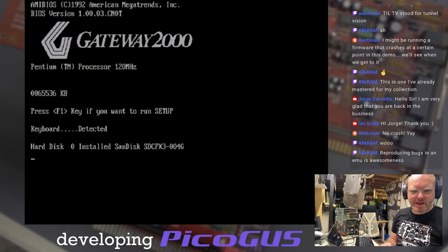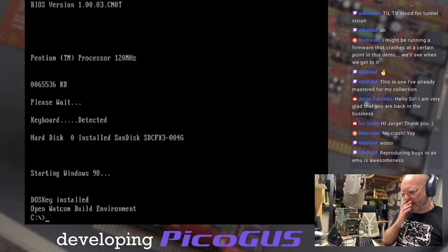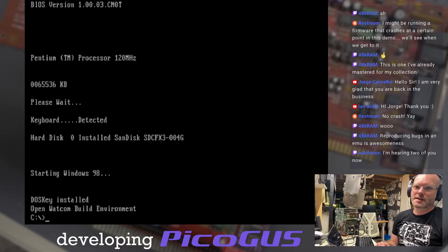I'm going to kind of switch gears and I'm going to go ahead and start digging into Game Blaster. Something that was pointed out to me in one of the videos, probably my last video I posted to YouTube, showing off Tandy and CMS/Game Blaster support, was that the pitch of the audio for Game Blaster is too high. And that had something to do with the fact that the library I was using used a lot of floating point math. And floating point math just kills your performance on the RP2040 microprocessor because there's no FPU on it. So it's all emulated in software and it is extremely slow. So I converted all the floating point math to fixed point math and I think I had a bug in it.